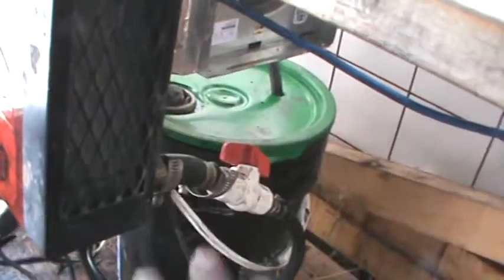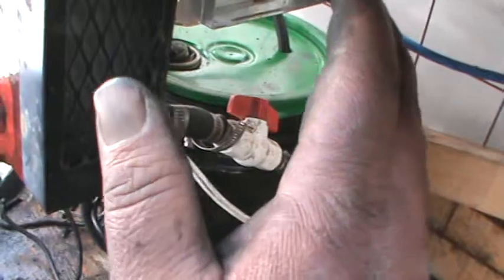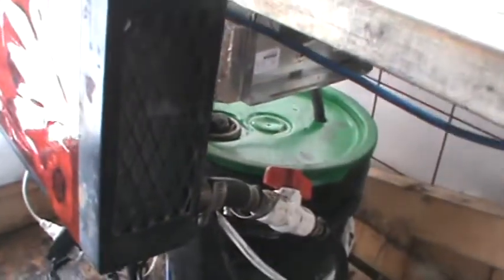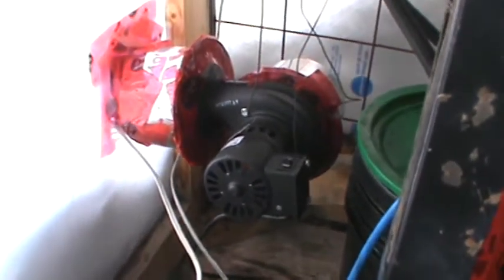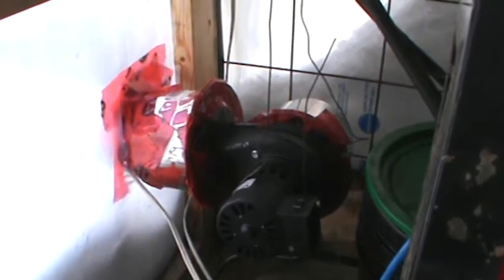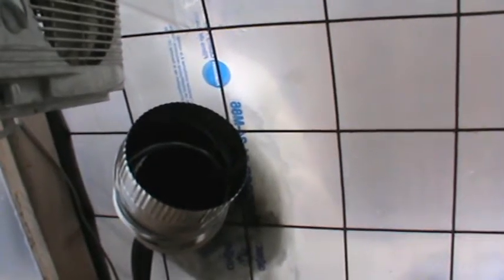This system runs constantly — it's filled with antifreeze for the cooler climate and just gently warms the greenhouse. Over here we have a fireplace blower fan that blows cold air through the cold air return through the stove and it comes back in right here, so this one does the quick brunt of the heating.